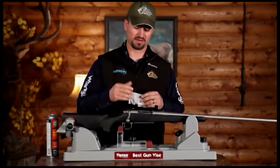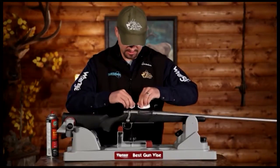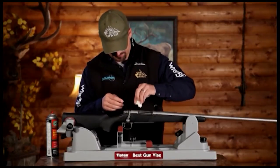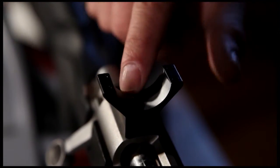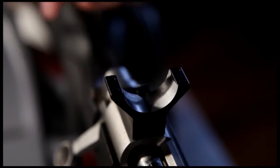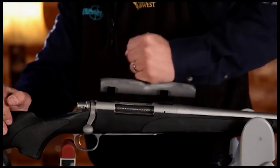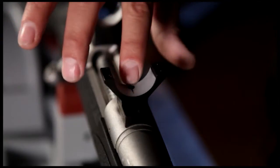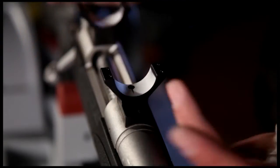We can show you an example of what 50% looks like, then we're going to go back through, lap it again, and show you what it looks like completed. One important thing when cleaning out the lapping compound is to wipe everything away from the screw holes — you don't ever want to get anything in those screw holes on your rings, it'll cause a lot of problems. Now that you can see we've got about 50% of this back ring lapped, we need to get about 80% on that at least to make good contact with our scope. So the next step is to reapply our lapping compound, get aggressive with it, and finish it out. Now that we've got them all cleaned up, we've got about 85% of the anodizing wore off — that's what we're looking for, somewhere between 80% to 85% range. The lapping did a good job on these, and now we're ready to mount a scope.